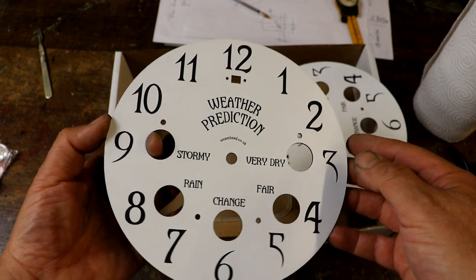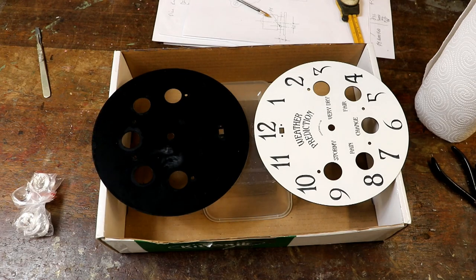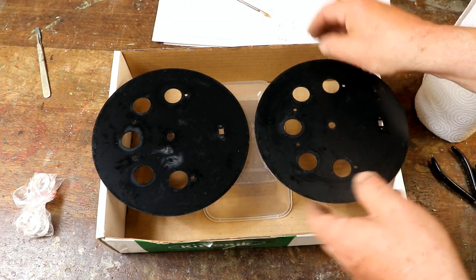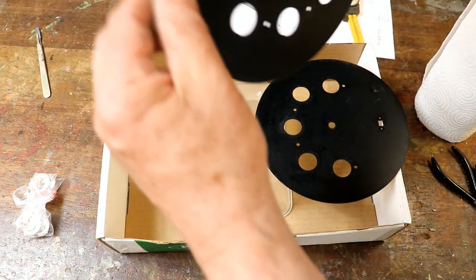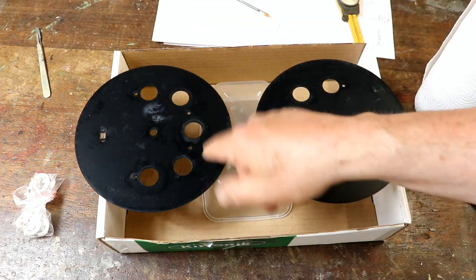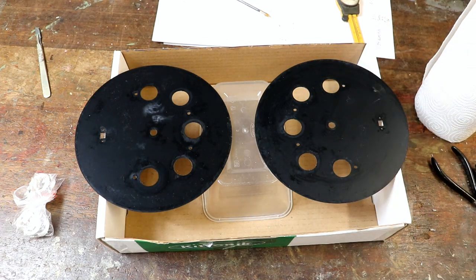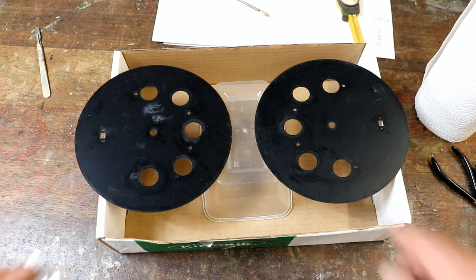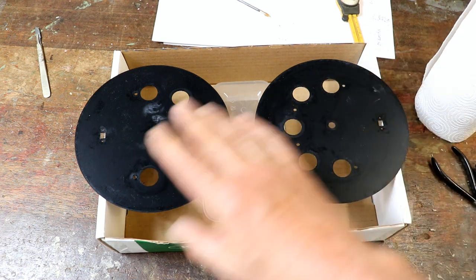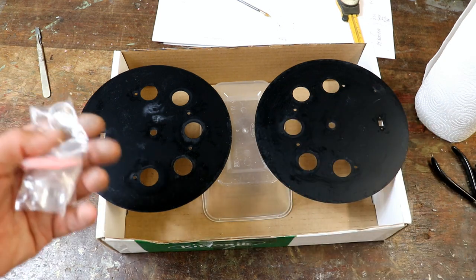What I'm going to do now is glue the lenses in the back, so I support them so the lens holes are clear. I'm also going to try and reduce, because I've been touching this to clean it, and may have some grease from my fingers, oils and things, around the inside of these, and I don't want that white mist to appear when I drip the super glue on. So I'm going to lay them all in and then put them under the blower, and just a small movement of air I've found actually stops it, disturbs it from settling, this funny sort of misty stuff.